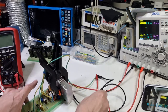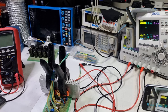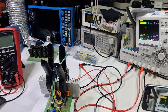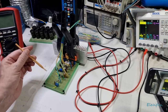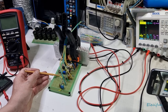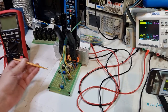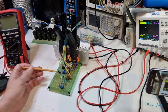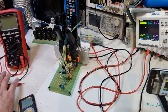I've put this into synchronous mode. I did find a mistake — quite a visible one if you look back at the other video. This wire was actually coming down from the base to the wrong side of the resistor. That meant I was getting quite a lot of voltage on the output, which is no good. So I've corrected that.